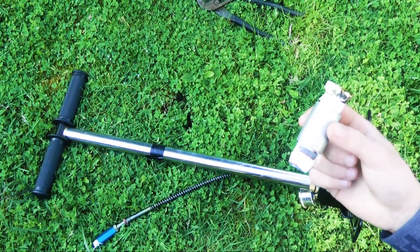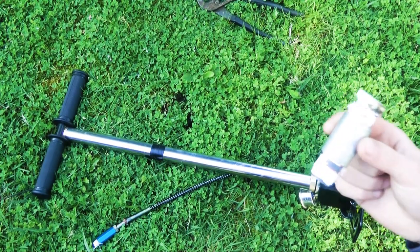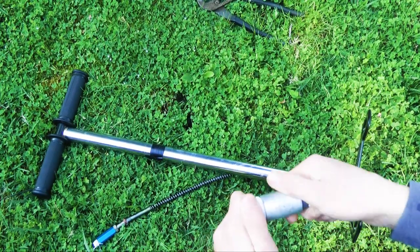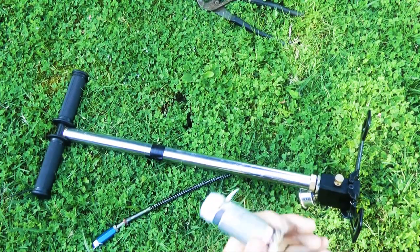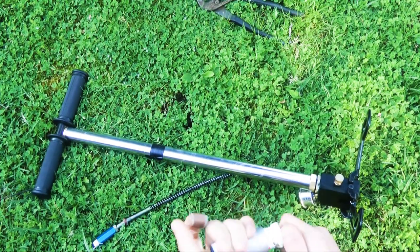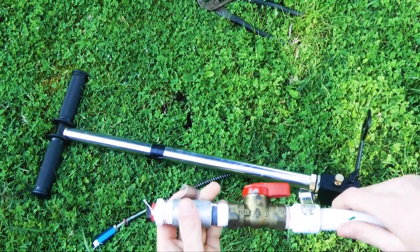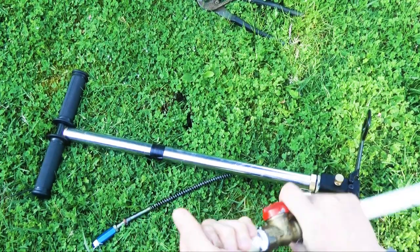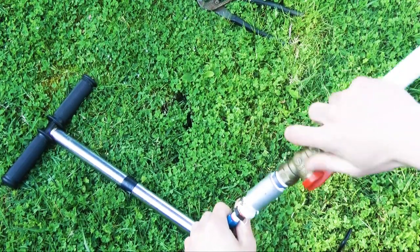Even if you have metal parts, it's still super dangerous. 4,000 psi is like — if this were to explode, it would be the size of an M80 most likely. If one of these metal parts were to explode at 4,000 psi, there would be some serious damage, and you just don't want that happening. So we're never going to take it that high. Whatever you shoot is going to have to be very, very, very light, otherwise the kickback is going to put a hole in your shoulder. I would recommend not building this at all — just don't.